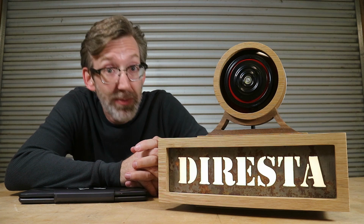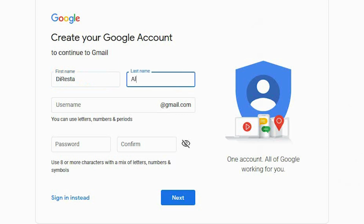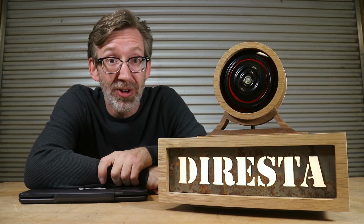Now, while we wait for Jimmy to make something, I'll explain a little bit what's happening right now. The Raspberry Pi that's powering this thing, I just gave it its own Google account and subscribed it to Jimmy's YouTube channel. Every few minutes, it wirelessly checks its Gmail account for a notification that Jimmy has uploaded a new video.